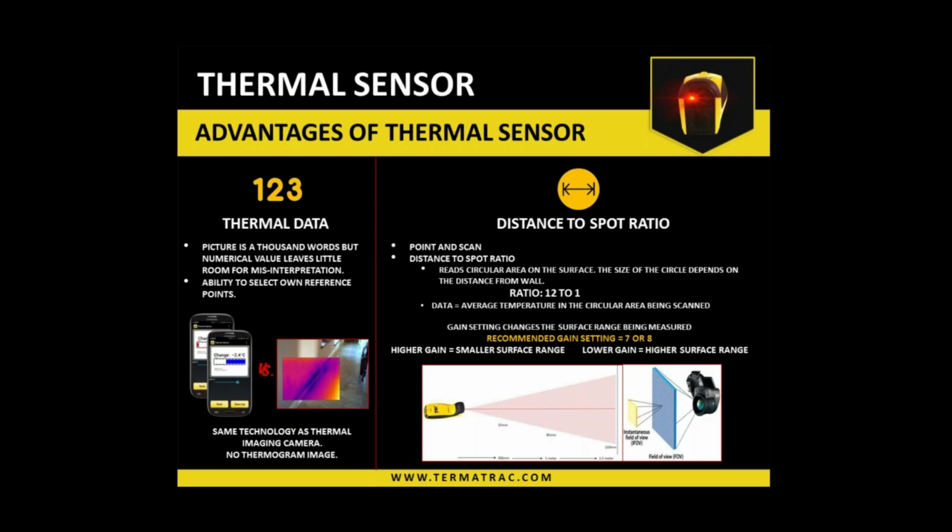Okay. So for a large area, we have to use thermal or moisture meter, and then we have to come down to the bottleneck, the radar. Yeah. Well, yes, that is one way of doing it. Obviously, you know the construction of the buildings you're dealing with. You know the areas where predominantly the termites are making their access, like was mentioned earlier, coming up through electrical conduits and so forth. So if you have common areas on these structures where, due to construction techniques or other equipment used, i.e. the conduits where it's running, things like that, or water pipes, you can use the radar specifically in those areas if you like, without using the thermal or without using the moisture. You can do that. Okay.